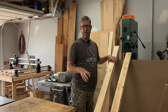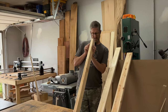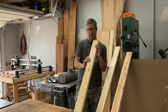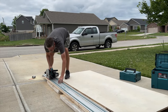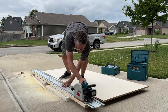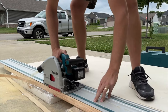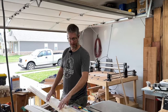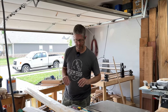For the rest of the platform frame I'm going to use two-by-fours. I don't have my joiner up and running so these aren't too bad — they just have a bow to them. So I'm going to rip a straight side on the track saw and then take them to the table saw and rip the other edge at two inches like we need, and it'll be good and strong. I haven't moved my fence yet so I'll go ahead and rip these two-by-fours the same as I did the side pieces for that platform — that way everything will be uniform.